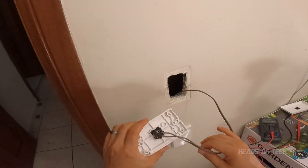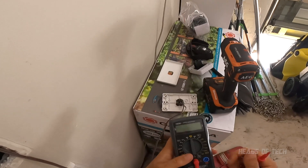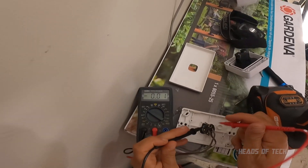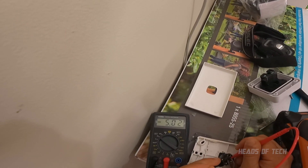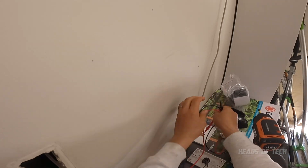As you can see here, this doesn't look like a high voltage cable, but to be safe, here's a multimeter. On a multimeter you get DC and AC - I'm gonna test for DC. I'll just put the probes together and I can see it goes to around five volts. I've just got the wrong polarity, but that's five volts - so it's safe for me to work on.